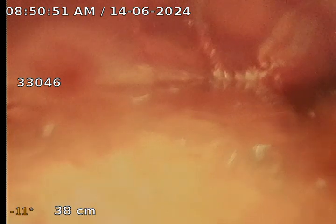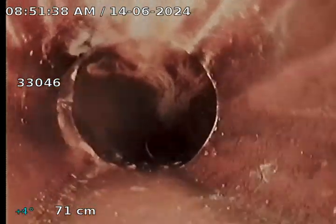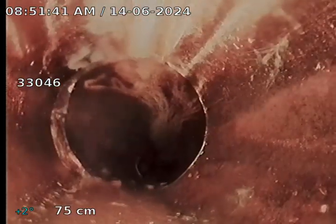I'm just working my way through a pit now, which is near the right rear corner of the home, and I'm working downstream towards the curb. We're showing roots — it looks like we are showing some signs of roots right here at the outlet. There may have been roots right there at the outlet, but we'll continue down and just see what sort of condition the drain is in before I work on that.